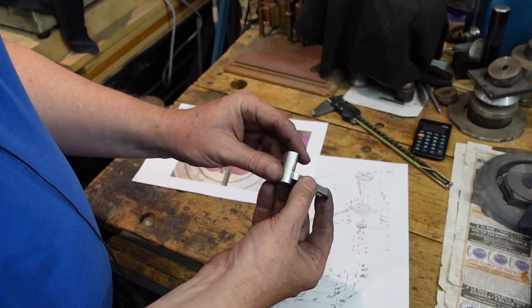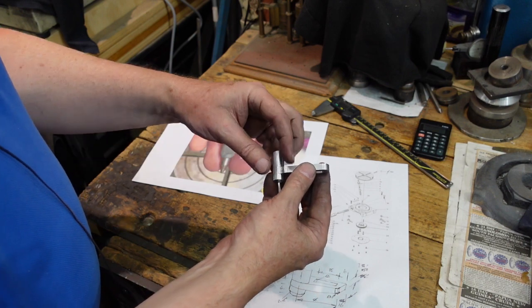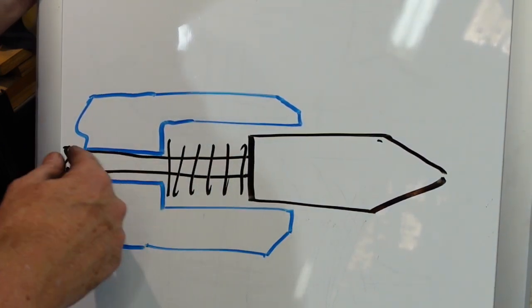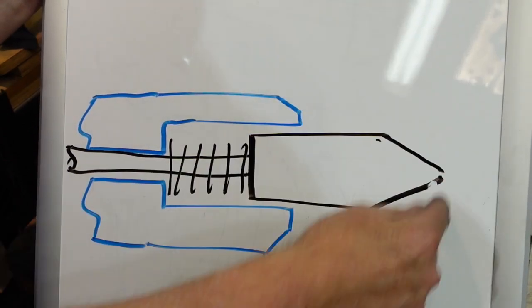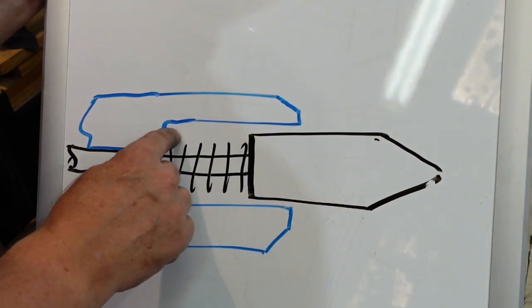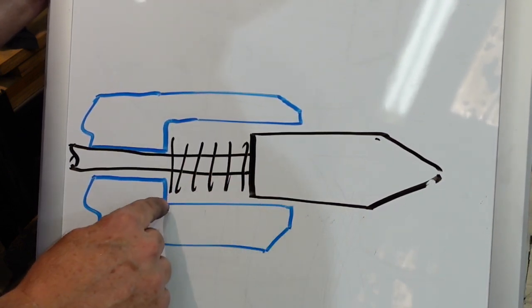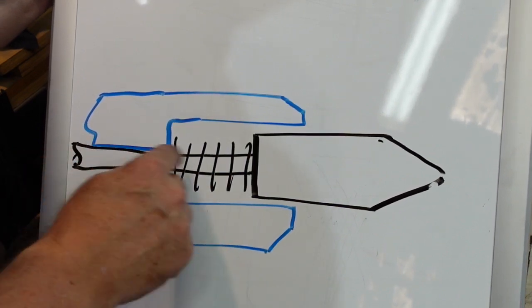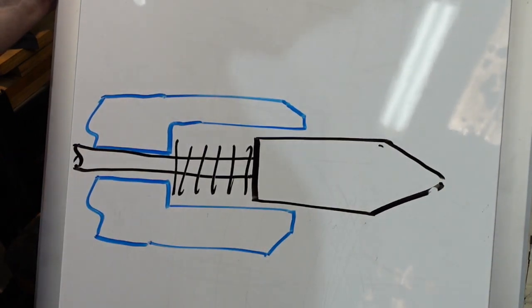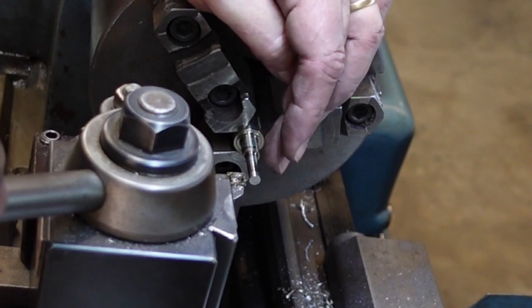I've managed to blend that in and put the slot in there for attaching to the table. Now I have to work on the latch part, which is a little bit tricky. There's a spring in here, and as you pull back on the handle the plunger comes in and disengages from the indexing wheel so you can index. I've got to find a spring smaller than the plunger diameter of around 9-10 millimeters, counter-bore the housing for it so the shaft on the end of the spring acts as a guide while the spring pushes the plunger.